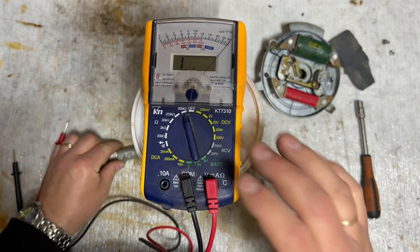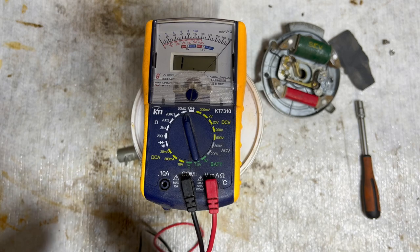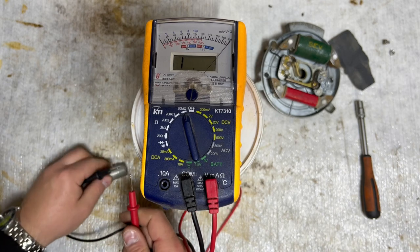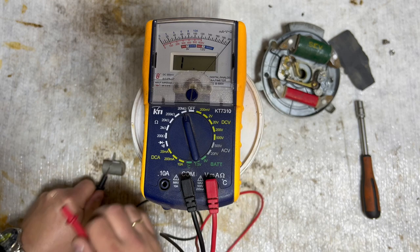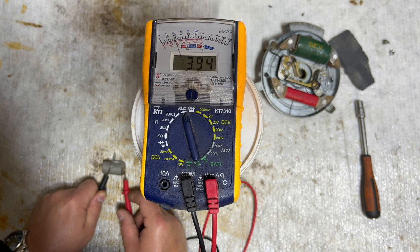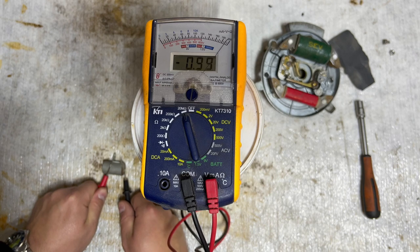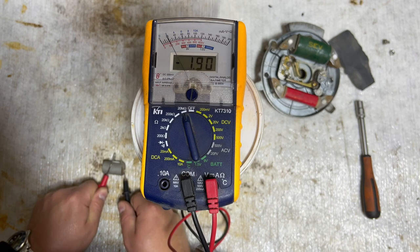The needle should move as slowly as possible on this one. If you have an option for even higher reading, put it there. We're going to start by putting the minus on the side of the capacitor and the red one on the top of it. As you can see, the needle moves nice and steady upwards, the numbers change a few at a time - a really nice reading, this is what you want to see in your capacitor. We then remove the probes, switch them, put the red on the side and the minus on the top.